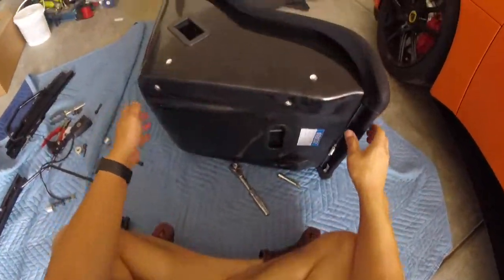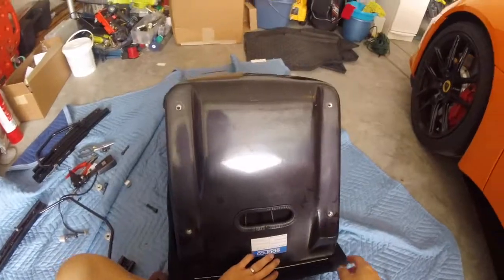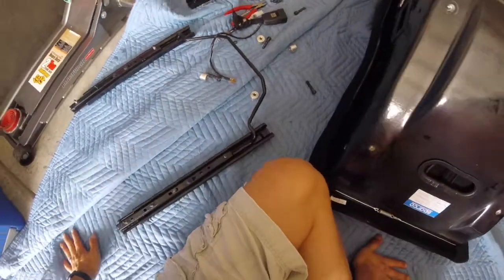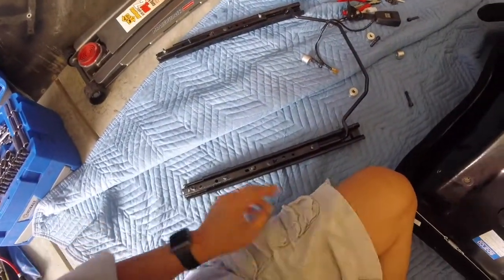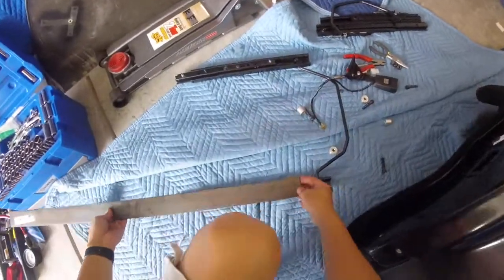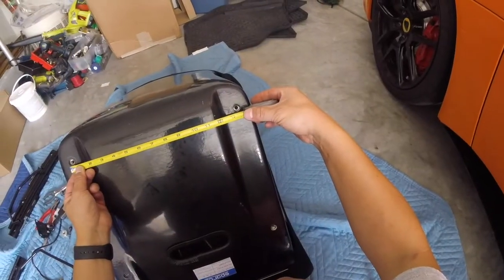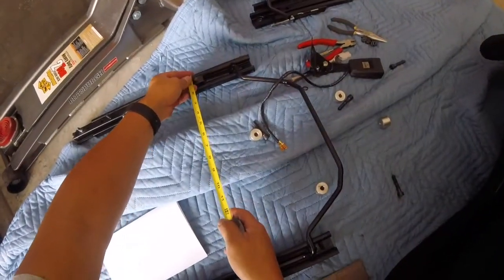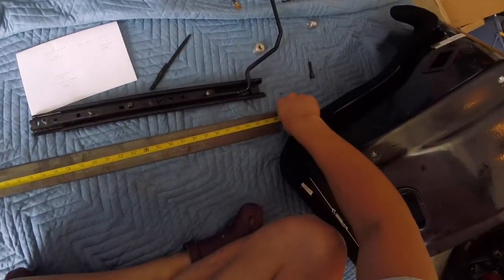What we need to do is basically measure the distance between the two holes here, and then measure the distance between these two holes, and then I'm going to make a metal piece that goes across from both to cover those two. Now some people may say you should do it another way, but we have plenty of space and so it'll square it up nicely. Two little brackets like so — that'll square it up, or I could do it this way also. I'd rather just do it this way. We're looking here at 13.5 inches center to center between the two bolts — and let's confirm, 13.5.